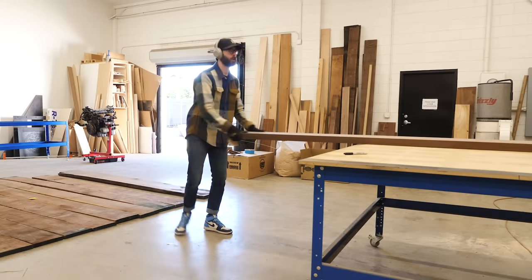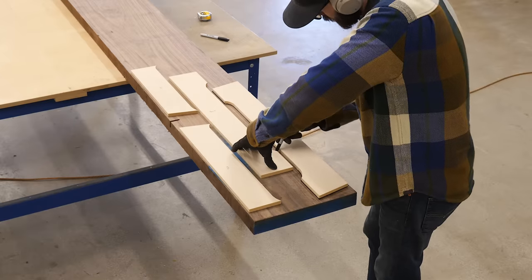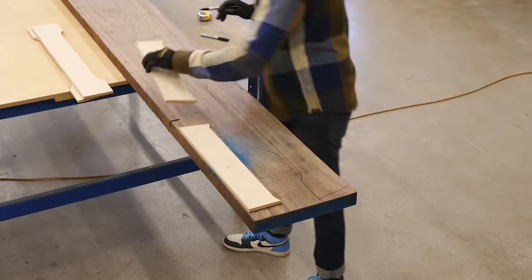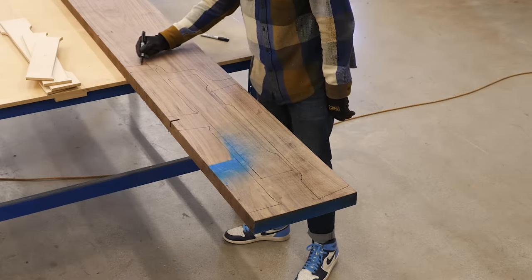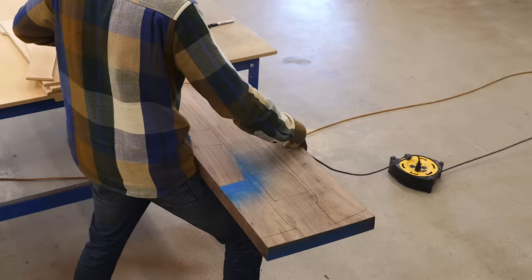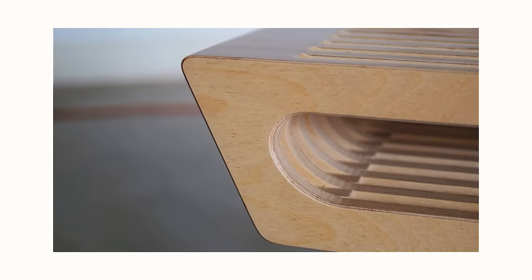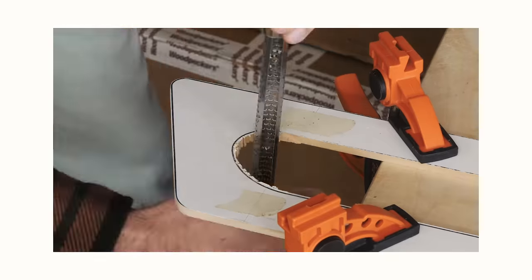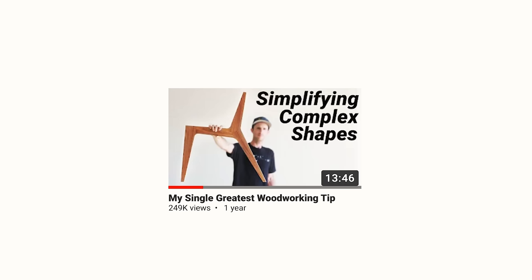Here I've got some eight-quarter material, and the first thing I'm going to do is cut it into oversized chunks that'll eventually yield our leg pieces. You can see I'm using some templates to help me size things. Anytime I'm making shapes like this with curved transitions and more organic shapes, using templates is my preferred method. Probably the easiest way to produce templates is by using a CNC if you have one, like you see me doing on the X-Carve in this shot. That said, you don't need a CNC to make templates — last month I made a coffee table that utilized templates which I made by hand using a paper printout. If you want more detail on that workflow, you can watch that video. I'll also put a link in the description where Sean laid everything out really nicely about how to make templates.